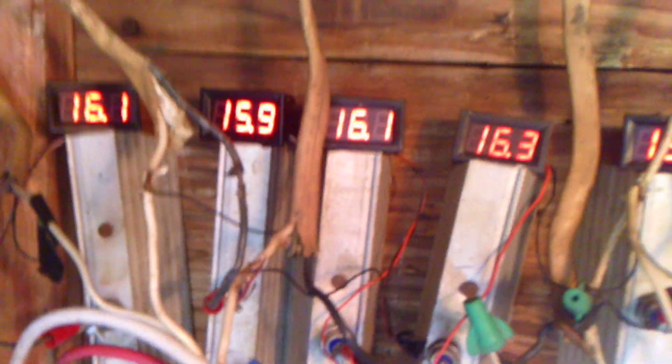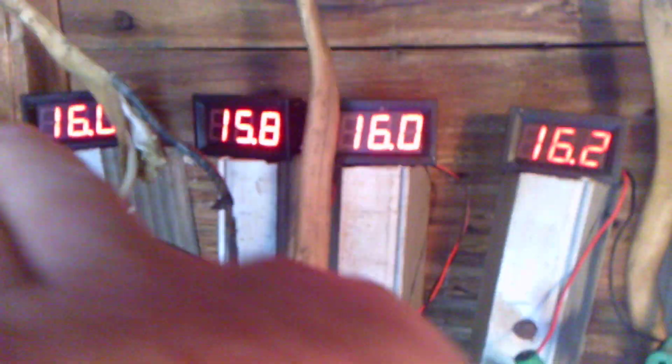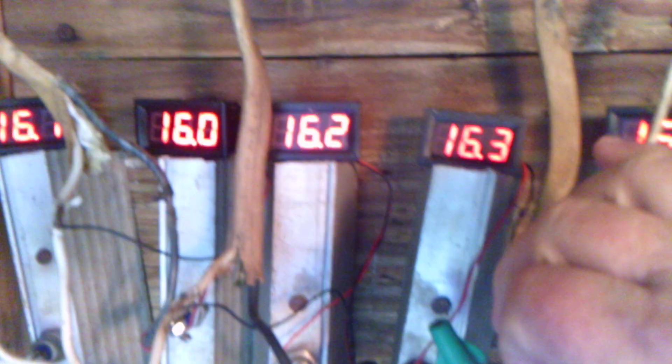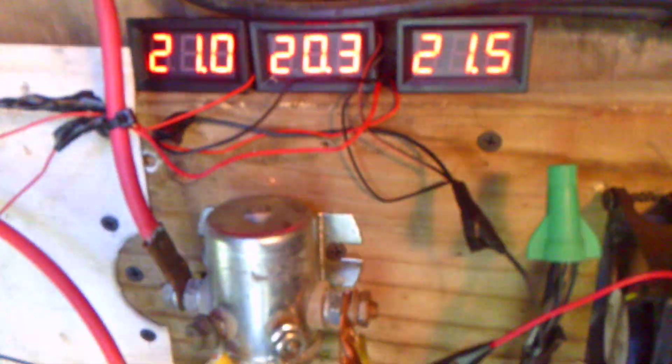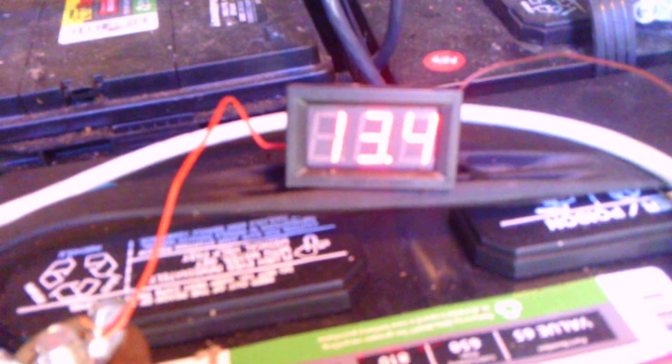There's the solenoid and the diode. Usually when they're set they show up at 20–22 volts, meaning they're not being used. Right now it's drawing off all the solar panels — you can see the top of my solenoid is warm. Down here's the same thing, this one's working right now too. These stay off most of the time — see, they just shut off. I've got it set up in two separate ways because it works really well like that. As you can see, my battery voltage stays constant at 13.4 volts, even when I've got most of the stuff in my house turned on.